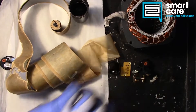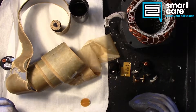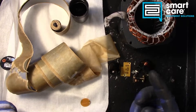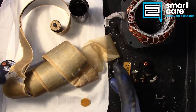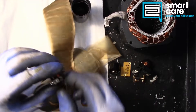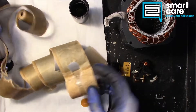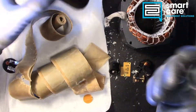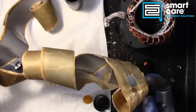That's pretty much it for compressor electricals. It's a pretty simple set of parts. They work in interesting ways, but they're not particularly complex. We've got relays with terminals opening and closing, we've got the capacitor with its kind of oily paper and thin film. When we talk about failures, it's almost always amp or heat related — you draw too much current through, you boil out the oil, you get the capacitor too hot. You'll see that oil come out through the top when you open the little cover. Relay failures are the same deal — almost always amp related.